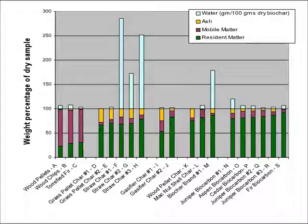What happened was, and I'll explain this, we have a device that takes wood and makes char out of it. And we spray it with water to cool it off at the end. Well, when we switched to straw, we put the same amount in the bin, but it was about a quarter of the weight of straw. So when it came out and got the same amount of water to cool it off, needless to say, waterlogged. So it's an artificial effect, quite understandable. But if we were going to go to the market with that, we needed to dial it down and get it right.